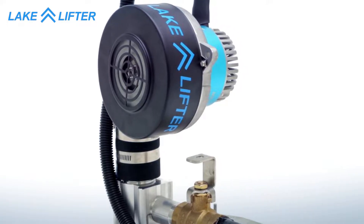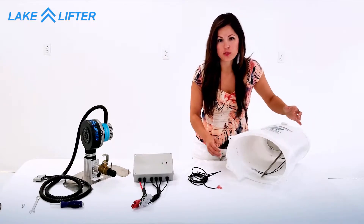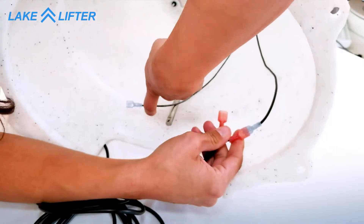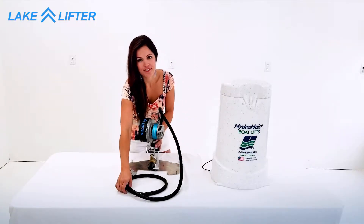Take the trigger switch wire from the control box and connect it inside either to the switch or to the existing switch wires. Then replace the cover over the motor.